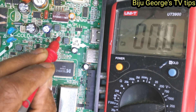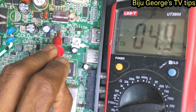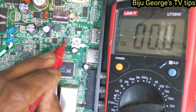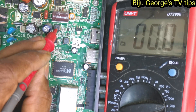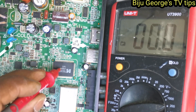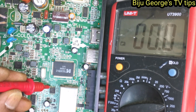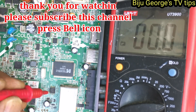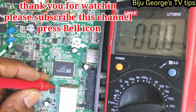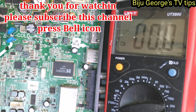1.1 volt — this is 1.1 volt. 4.9 volt this one, 4.9 — this one 1.1 — this IC working voltage. 5 volt here, 3.9 volt here, 3.3 — this IC, memory IC working voltage. Pin number 8, pin number 8 working voltage. There is all voltage — everything noted: 3.1 volt, 3.1 volt, 5.3 volt. There is the full filter measurement.